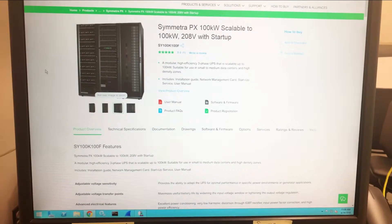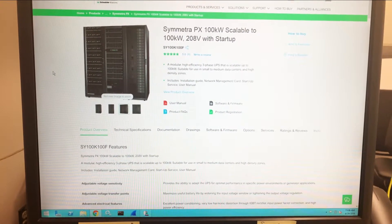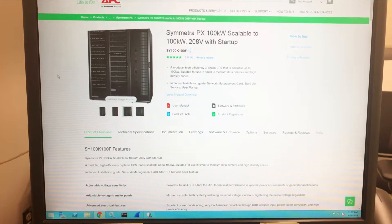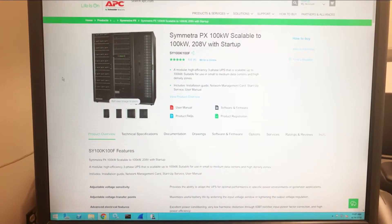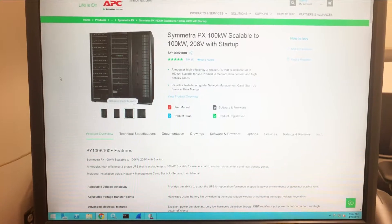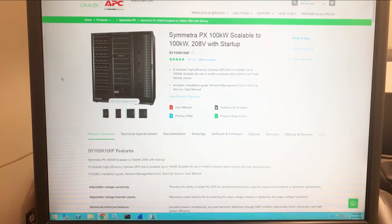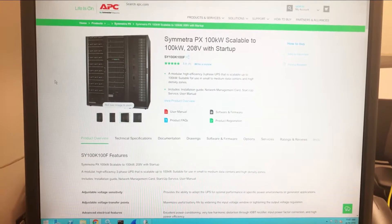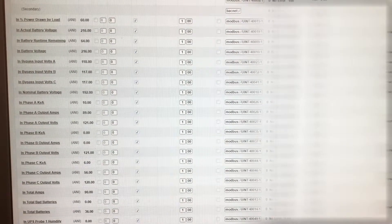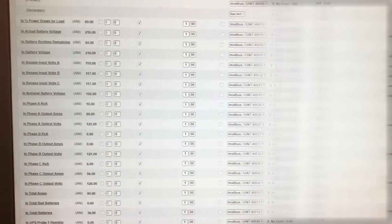For copyright reasons I will be omitting the BMS software in use and any applicable data. I will be showing the bare minimums — no programming or graphics — just a basic setup for the Modbus integration points and some general notes for working in the field that are not made very clear by Schneider Electric or APC. This is the point setup page for the third-party BMS system on site.